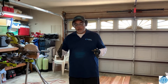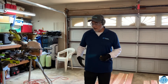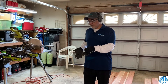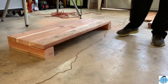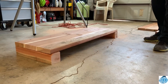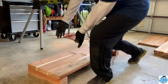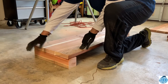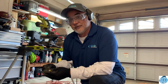Now that all of your cuts are made, one of the first things you want to do is assemble the end pieces. Get three of your four-foot pieces and stack them on the four-by-four by sixteen-and-a-half-inch pieces. Stack three of the four-foot pieces on top of one another, make sure it's nice and square and even all the way around, and then start fastening some deck screws onto it.